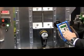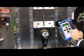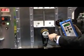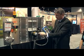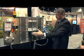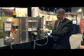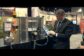We can now change this to output mode. Changing to output mode blocks the pulses from the whirligig and injects the pulses into the M800 speed switch. So now the system is monitoring what I've got on the display here, not what's on the machine. Now I can start to drop the speed down.